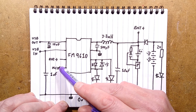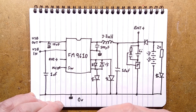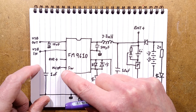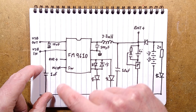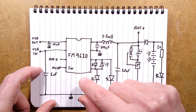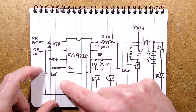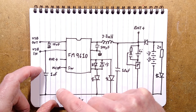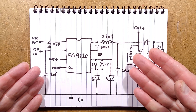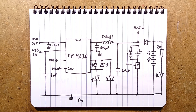Two of the LEDs go to the zero volt rail and the other two are wired across it, so by swapping polarity it can light individual LEDs. They display a bar graph and that's how they've done it. The switch input - normally a push button on an ordinary power bank - has double function. There's a resistor in series because the pin puts power out as well. When you press the button and pull it to zero volts, it wakes the power bank up and also turns on the light if you double-click or long-press.